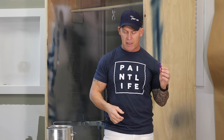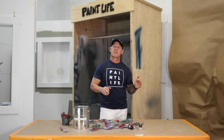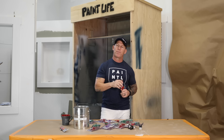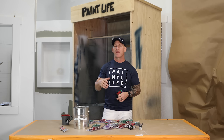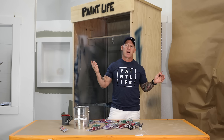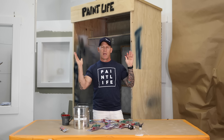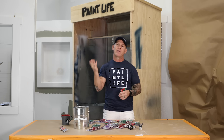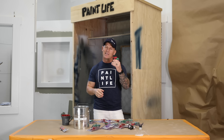I spent about eight years painting cabinets — every single one with water-based products and fine finish tips, predominantly a 310, occasionally a 510. I really like to simplify my processes: I simplified tape down to just one-inch and inch-and-a-half sizes, just production tape and frog tape plus a high-tack tape. I eliminated all the different paper sizes and for the last 15 years have only used 9-inch paper on everything — doubling up if I needed more, folding or cutting if I needed less.